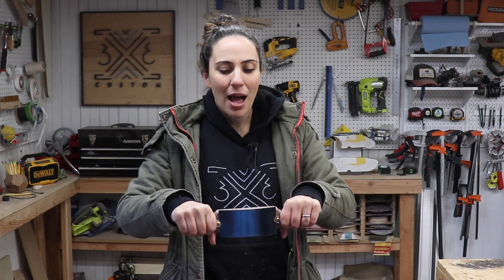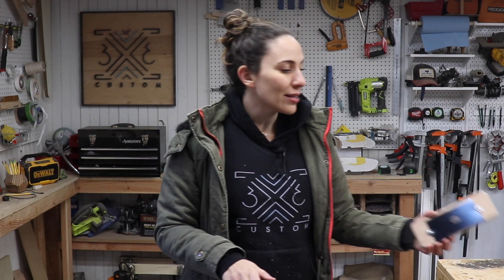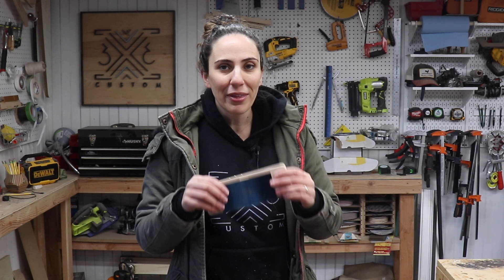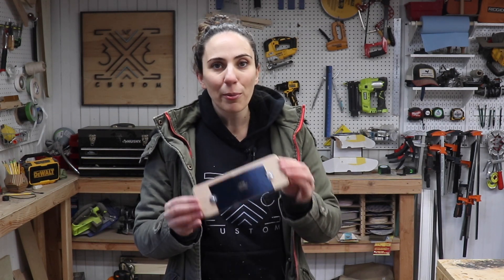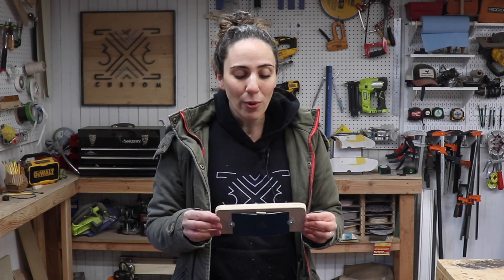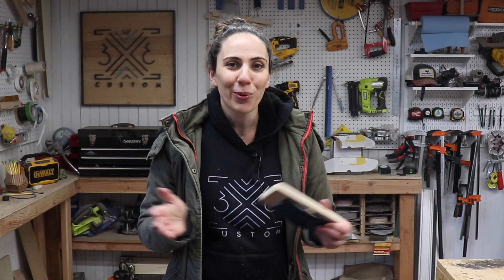I really did not like holding the handles on the side at all — I didn't feel like it had enough pressure. It is definitely more comfortable to hold on top, and that's why the simple plywood one was so much better. I can just hold it on the top and scrape away. I really felt like I could do this all day long without any thumb pain, which is amazing. I know some people say to put a magnet behind it to prevent heat, but I think this simple piece of plywood with a couple of screws and a bolt is really going to change the way I use the card scraper. Thank you guys so much for watching — I hope this was helpful, and now I'm going to go work on some more projects.